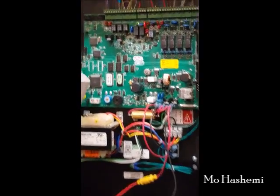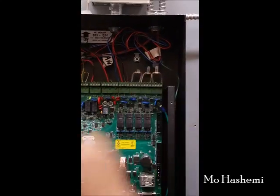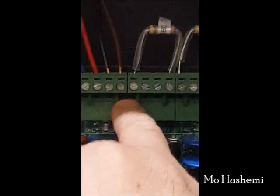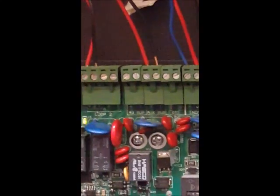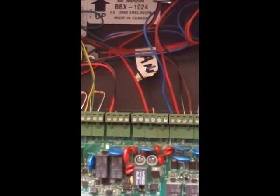When you open this panel, you will see some wires here. The bell circuits for a Mircom panel are called IND — indication. IND is the best information you can get here. This panel has two bell circuits. The other bell circuits have an end-of-line resistor because they are not being used. Because this panel is addressable, we have a loop. The loop replaces the detection circuits found in a conventional panel — this panel has a loop because it's addressable.